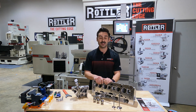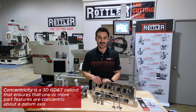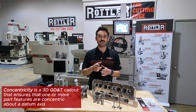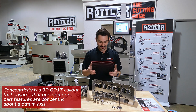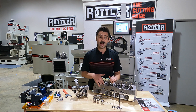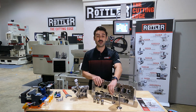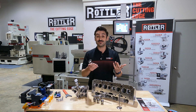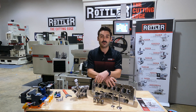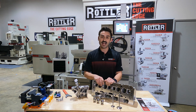What is concentricity? Well, the engineering or technical definition is how close the centerline positions of two circles are. When we take our cylinder heads, you've got your valve guide and your seat. Your valve is going to have the stem in the guide, and the seat should be sealing against the seat of course.